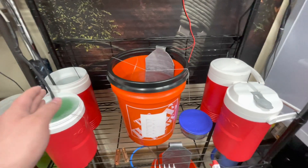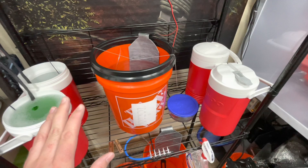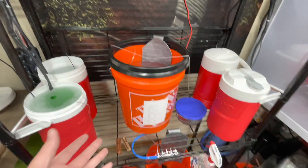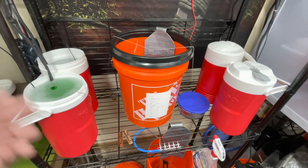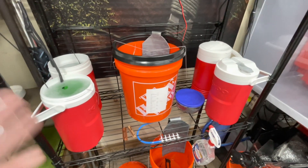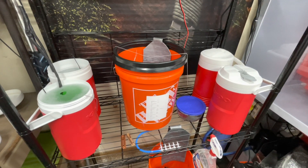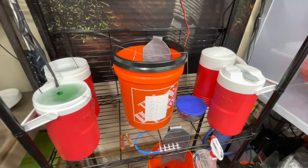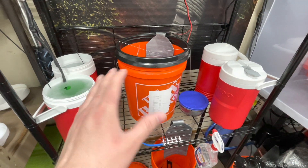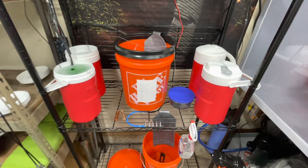All four of these stages are heated; the other two are not. The anodizing bath needs to be between 68 and 72 degrees, which is kind of hard to maintain because your shop could be significantly hotter. I've heard of people using frozen bottles of water to cool the bath down. It gets 100, even 110 degrees here, so that's way over temperature. I'm thinking frozen bottles of water plus a heater — if you put a frozen bottle in and put a heater in, they'll kind of battle and keep a stable temperature, because a cooler is a lot more expensive than a heater.